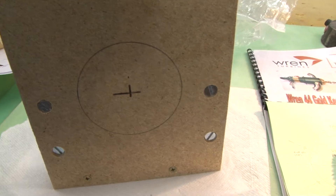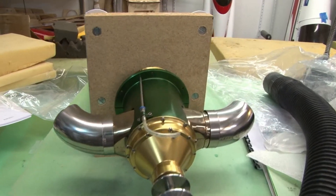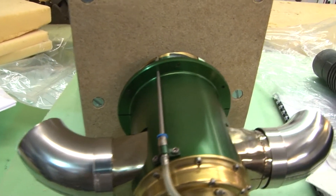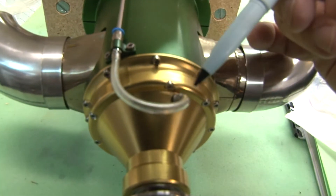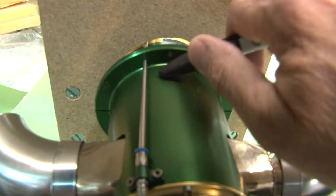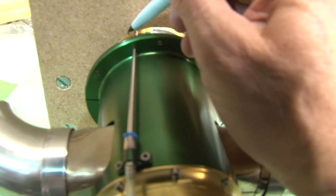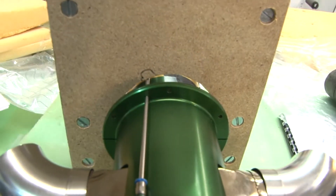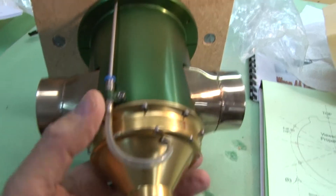Okay, well that wasn't too bad — the basic hole is done. Now there needs to be a notch put in for the lubrication line, which lubricates the gearbox, because it's outside the diameter of the mounting hole. So we just put a little notch in here using the Dremel tool, and now the motor fits right up nice and flush against the firewall.